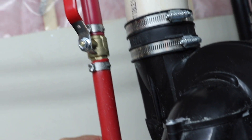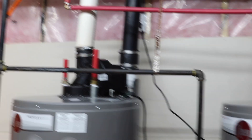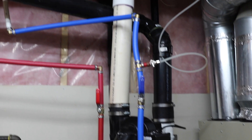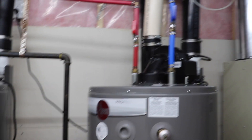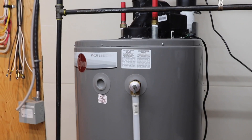This was a good job. Obviously this took a lot longer than if you just needed to empty or flush a tank, because initially these two tanks were together piped in series. We disconnected them, redid all the piping, and now we only have one 50-gallon tank of hot water for the entire house. The second tank is going to be used to heat the radiant floor. That pretty much wraps up the video. I really hope you found this helpful for your own project at home. I'll see you next time - take care.